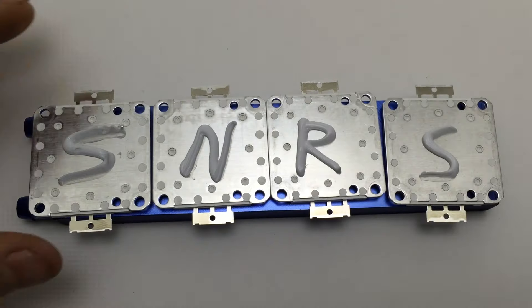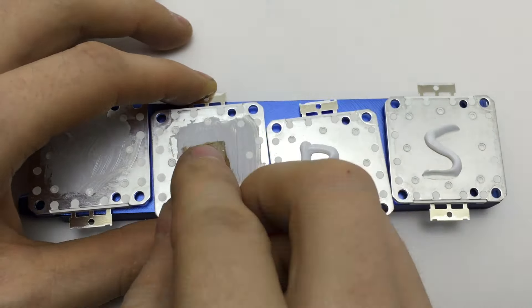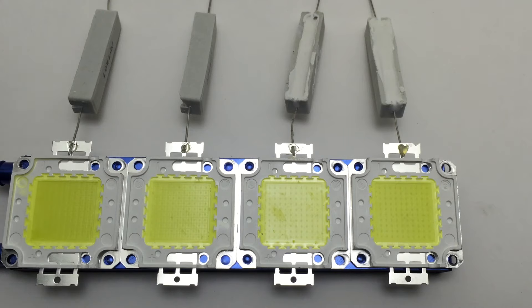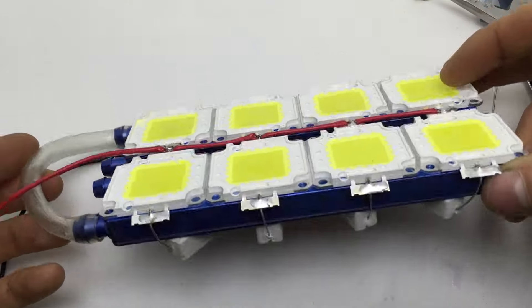Here's how I made it. I applied some thermal paste to the bottom of all the LEDs and spread it into a thin film. I then secured them in place with a dab of super glue. Each parallel LED has a large 1 ohm resistor in series. I bent the resistors around the backside of the water blocks and connected them all with a breadboard and some solder.